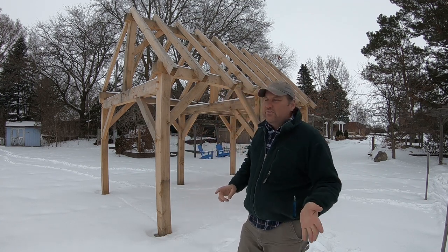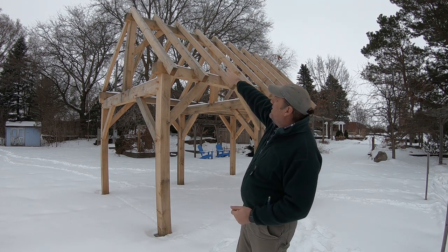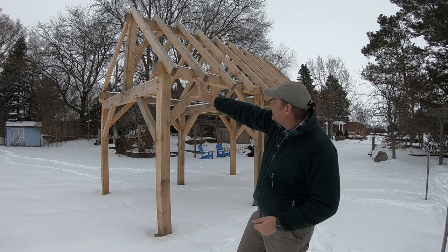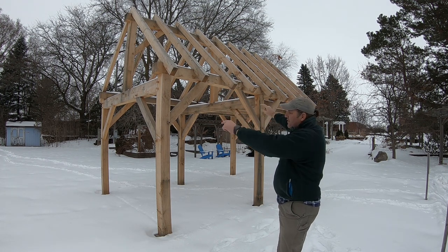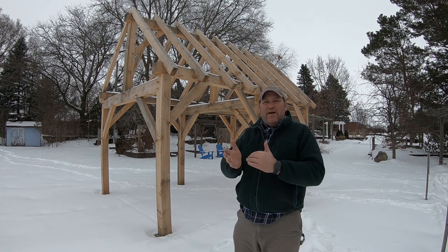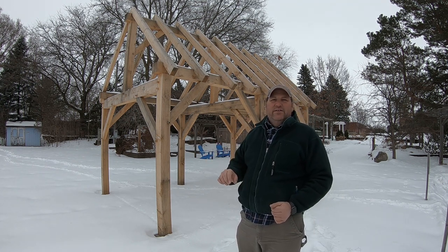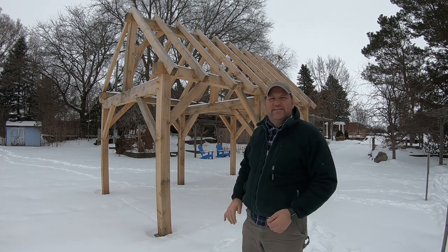So what we're going to be doing is adding another rafter to each end, plus I'm going to add three rakes on each side of the roof to hold that rafter up, and then one big fascia board all the way on each side. So that's all going to be milled 3x5 to match the rafters that are there. And then I'm going to be cutting the rest of the white pine to 1-inch slabs, planks, just to do the whole ceiling decking on there.